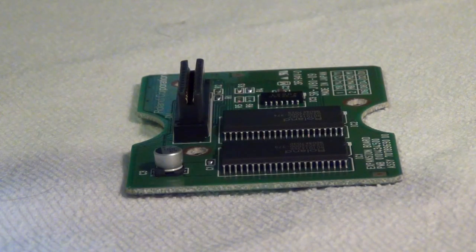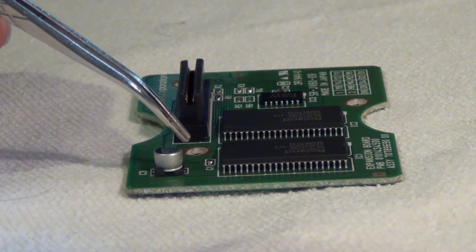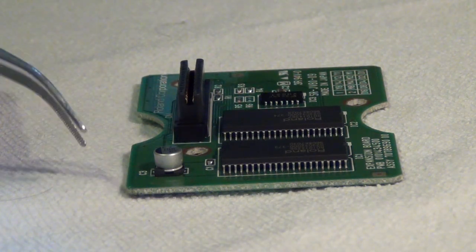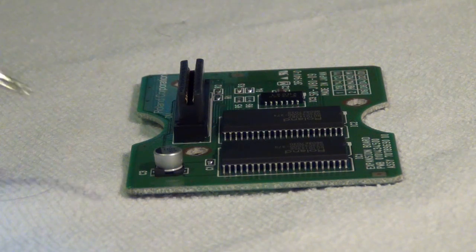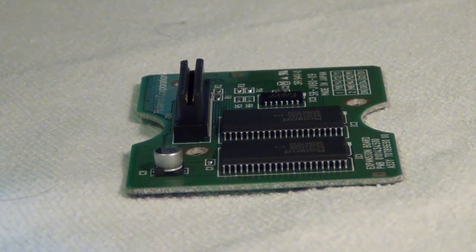As you can see, the soldering points here on the left and on the right of the card, they're really tiny. You can barely see them. And this is where we have to start desoldering the capacitor. So the best way is to do it like Don Solaris recommended, to grab it with pinchers and while desoldering to slowly wiggle it left and right. So let's try that.